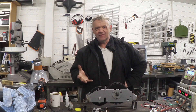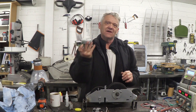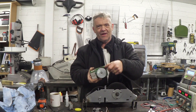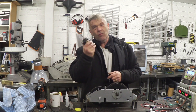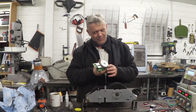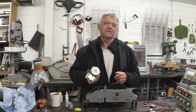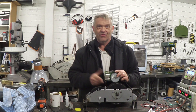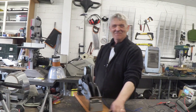Now, this is going to annoy some folks but - I was looking for something to make the smaller cog to go with the big cog we made, when I realized I have a few of these: printer motors. You'll notice it's just a great big drum, so that's going to be really easy to wrap the belt around and make it the smaller cog, with everything already mounted. I'm going to use a printer motor instead of the hoover motor just because I like it. Printers are just as readily available as hoovers, so it works out easier.